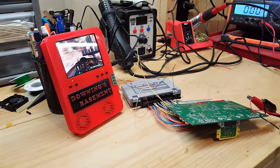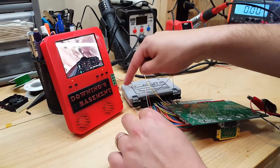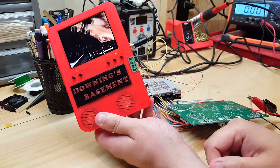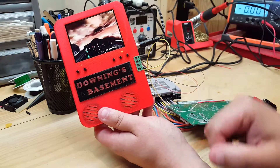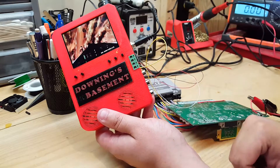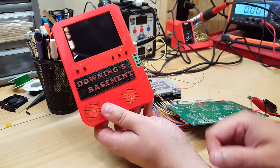I made it a little bit simpler too, because when I was using the other one, I still had to terminate these leads to the RCA, and that was kind of a pain. So I had this screw pin terminal that I robbed from some other project, and just fit that into the new 3D printed case. Now you can just use the bare wires and put them right in there and screw the pins down, and as you can see, it works out beautifully. It's a lot quicker, and you don't have to go through all the headache of terminating the ends.